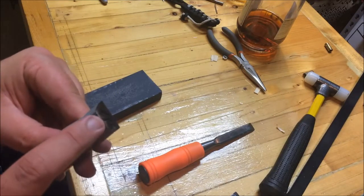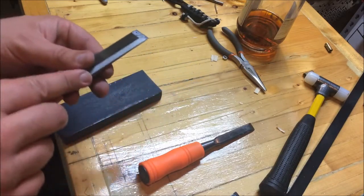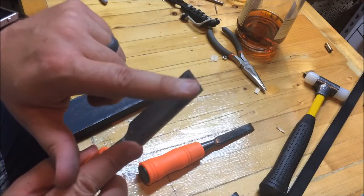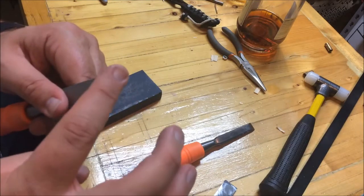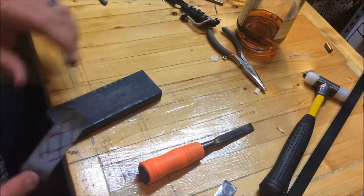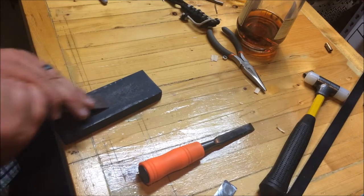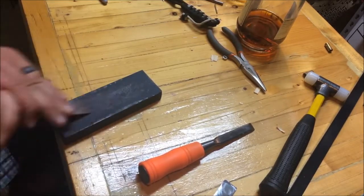What's interesting here is that the middle must be a little low. I don't know if that's showing up very well - I don't have all my lights set up, I wasn't planning on filming a video - but the middle is what's low. That's really fine because across the whole tip right there it is smooth and we've removed the sharpie across the whole tip. I can tell that's really sharp.